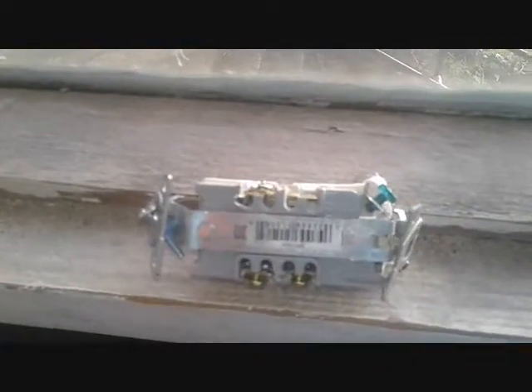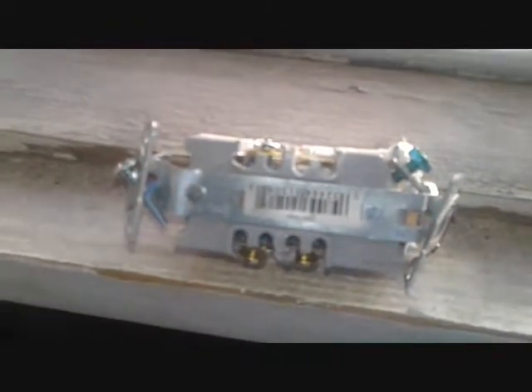When I come back I'll show you what I did. All right, I think I found the problem on that line. If you can see this here — notice that top left lug right there — it looks like the wire kind of melted into that. That's the neutral, and the neutral melted off the lug. That's why I like to wrap them around the screws. When I used my tester it showed the whole line was still getting power right at the socket, so I think it slipped off the neutral there, and because of that it took the whole rest of the line down. So I'm going to rewire this.